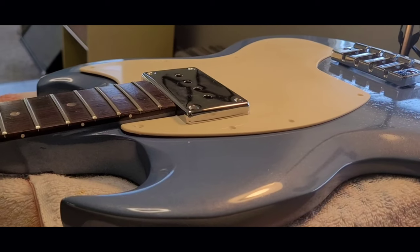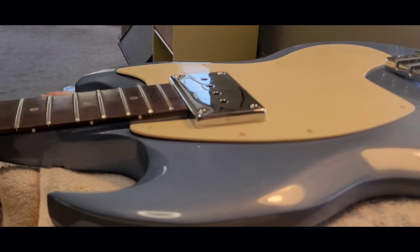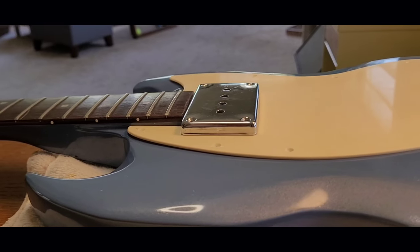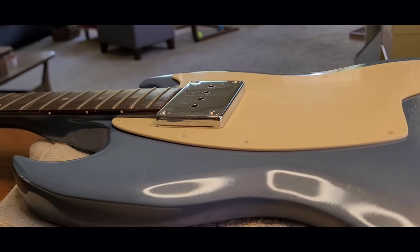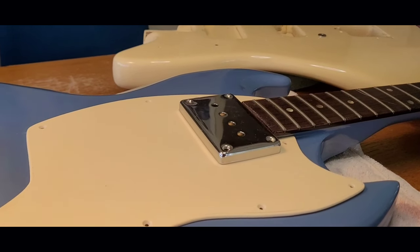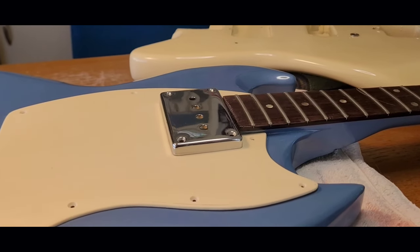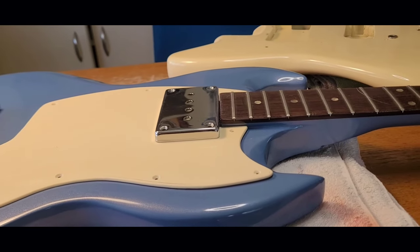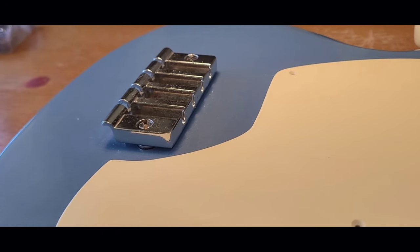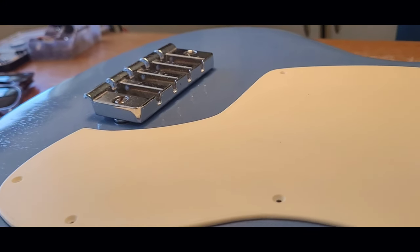So what I'm going to do is, very slowly and at my own pace, and this is why we overcut the pickguards the way we do, I'm just going to trim this line. I'm going to just drop this starting right on this peak and lower it down and then recheck my distance from the center of the screw hole to the actual side here and then cross-reference them with the rest of them on this pickguard. That'll let me know in my final steps that I've gotten really accurate and I've got a really good product there.